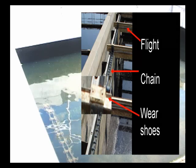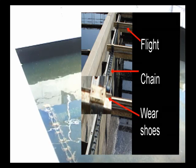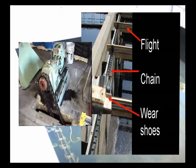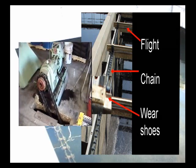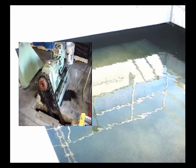The flights are usually wood or non-metallic flights mounted on parallel chains. The motor shaft is connected through a gear reducer to a shaft which turns the drive chain. The drive chain turns the drive sprockets and the head shafts. The shafts can be located overhead or below.